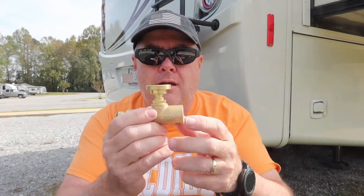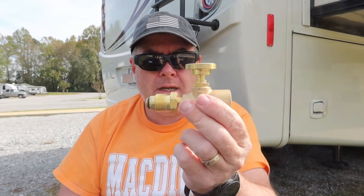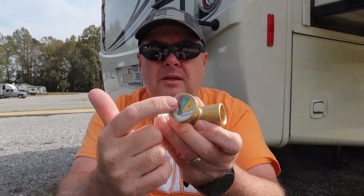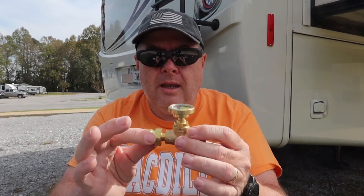It's basically the same design and construction as tank fill indicators you can buy at Lowe's or Home Depot, and this even has a tank fill indicator built in. This is very simple to install — you just unplug the hose going into the tank, insert this in between, make sure your connections are tight. You'll push this down to prime it, and when you do, the level indicator will go up and you'll know that you've got pressure and you're good. That's the entire install.